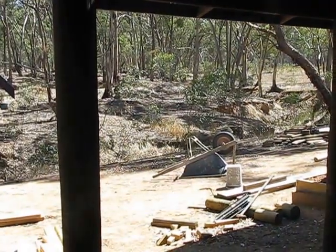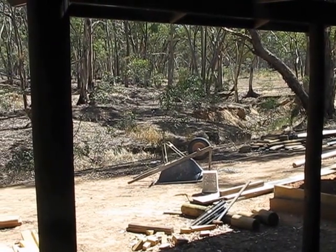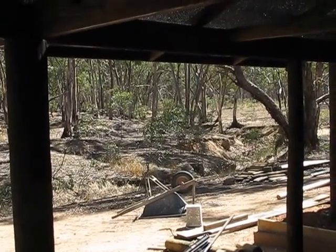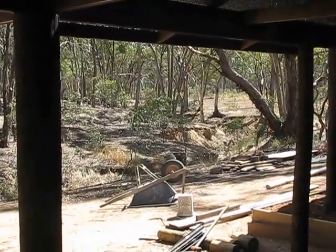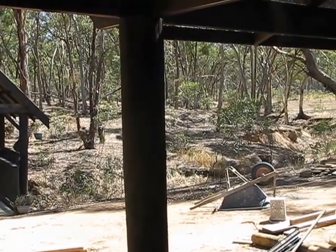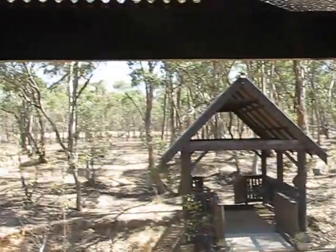I'm only going to talk about the poles in this one, and the main thing with poles is do your mark out as you would mark anything out. Square it off, diagonally square it off, make sure everything's as straight as you can get, and then set a level point somewhere. It can be a foot off the ground, 2 feet off the ground, about the middle of the pole I find is good. Then you can measure upwards to the tops to find your top levels, and then just build in an orthodox manner above that.